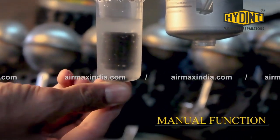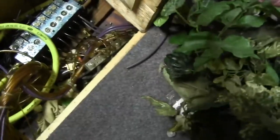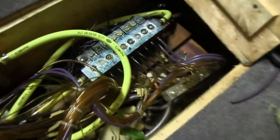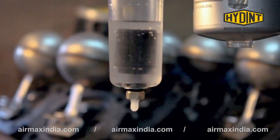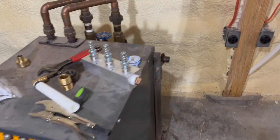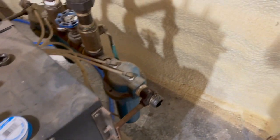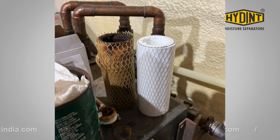It's not just an issue with the tank itself. Another issue can arise if water is not removed from the air before it reaches the characters. The moist air can destroy cylinders and cause the valves to stick, so the air has to be dry. For the drying system, I was actually able to use the original air dryer that came with my show. It had no issues and ran fine. I did have to replace the pre and after filters, but other than that, it works great.